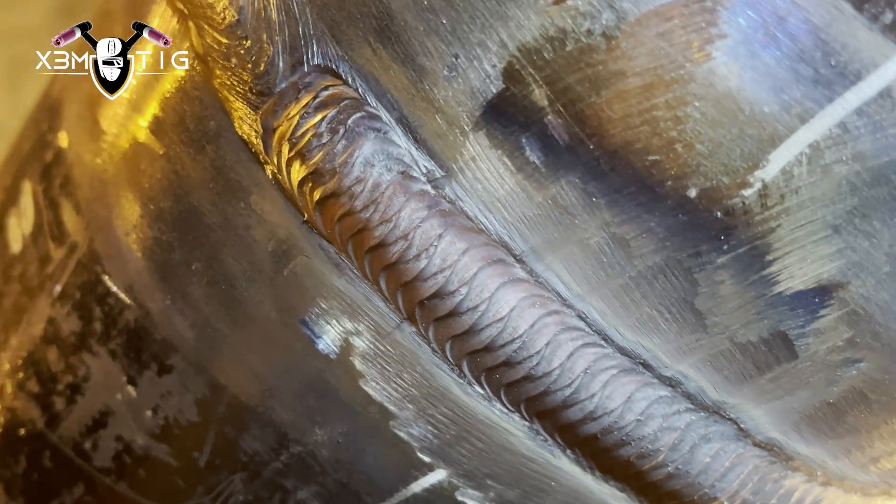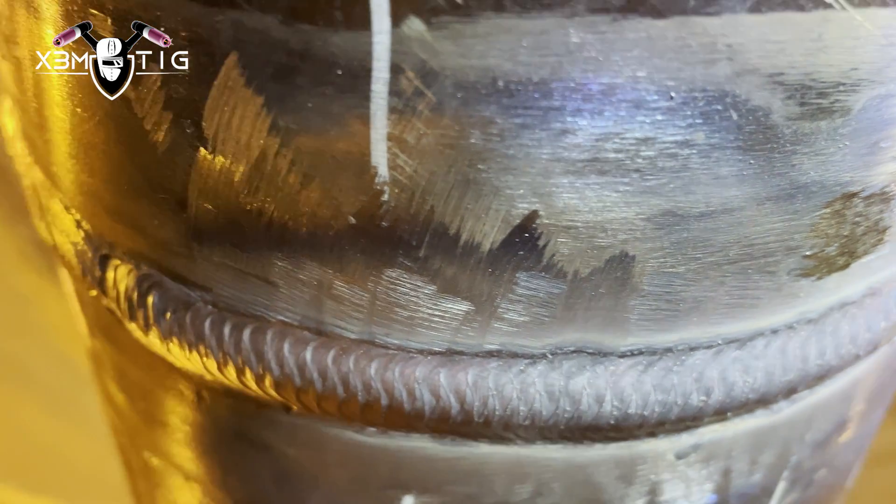There's a certain skill set required for overhead welding. You want to adjust your feeding speed, welding speed, and amperage. You've got to fight gravity and maintain consistency of your feeding to have proper penetration inside — enough build-up to be above that edge and be acceptable. You shouldn't be worried about x-ray as long as you make a nice build-up on both sides of the bevels, rebevel them, and keep that feather edge or 1/16 land. That's it guys for this video — I hope you liked it and learned something new. Like, share, and subscribe if you haven't, and see you in the next one. Take care and weld safe.